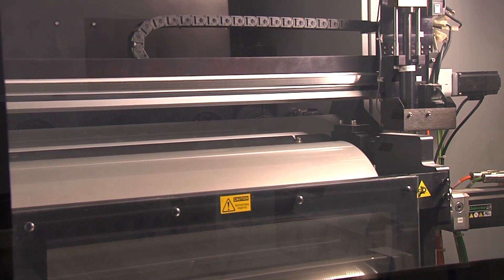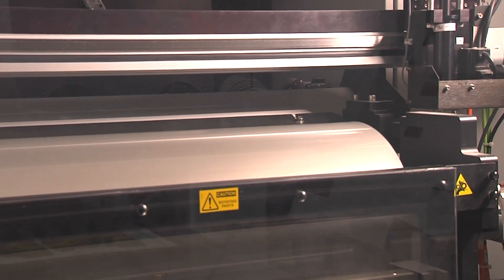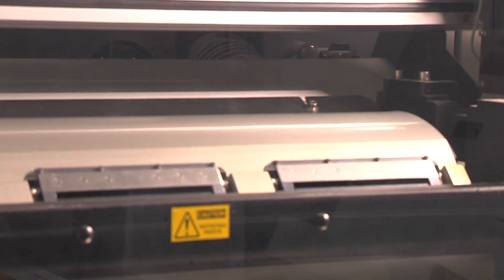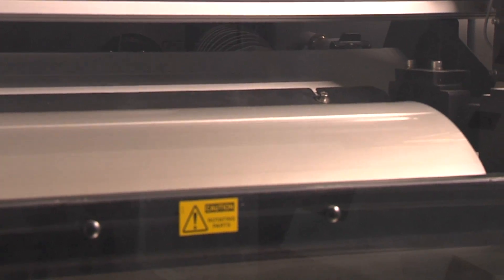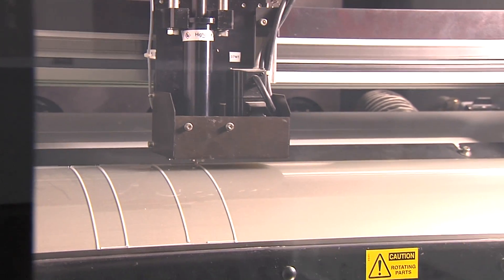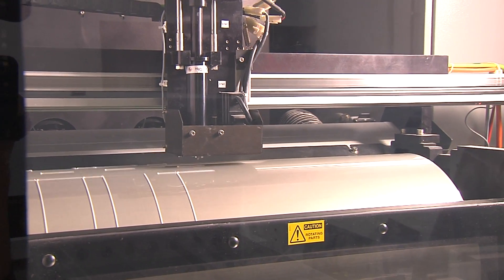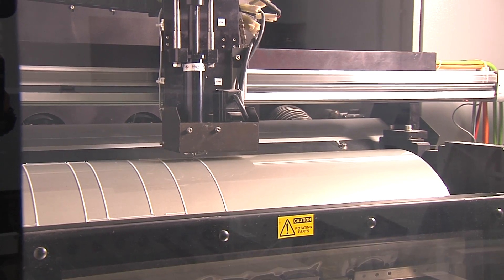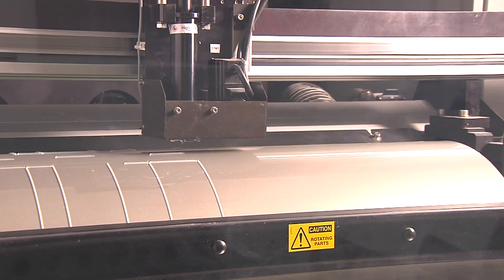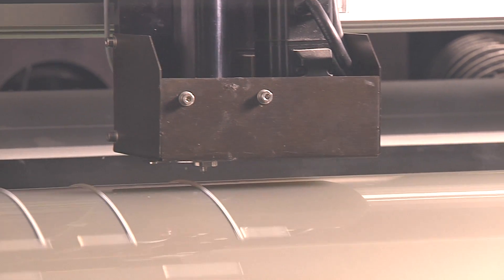What we have here is a DART drum, an upper drum with a foil mounted on top of it. On this foil, we will write the creasing rule, replacing the analog technology, replacing the crease in a normal die cutting tool. So what we are doing now is we are preparing the DART foil for writing. This is a quick process that allows the writing to be done on the DART. Here we replace the entire stages from preparing the file until we're on the machine. Imagine sending it out to the provider of a die cutting tool, having them prepare it through all the different processes, then shipping back to you, then putting it on the machine, doing the preparation and starting to run. Then you need to store it, you need to keep it somewhere. The entire process is now done in a completely digital way using the latest technology.